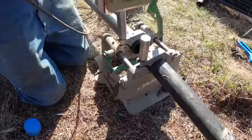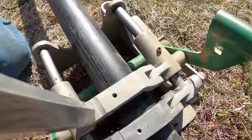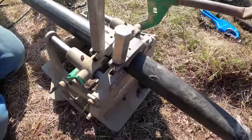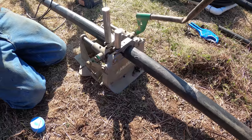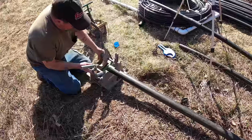Bead is what you want to watch for. You want to watch the bead roll over, kind of. Then you see how it folds out, rounded back, rolled back. Here you want somewhere around a 16th to an 1/8 inch bead. And as pipes get bigger, you want a little bit more.